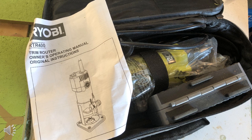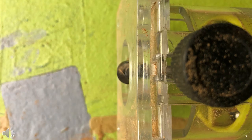Always use protection for your eyes and be careful when using it. Selecting the correct router bit is important as well. This shows the bit that I use on my router — it's rounded and as wide as possible, one centimetre, which was the widest I could find.